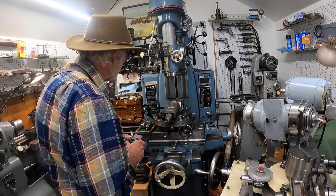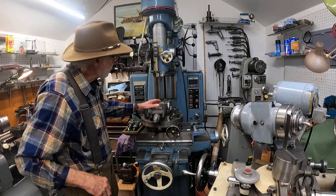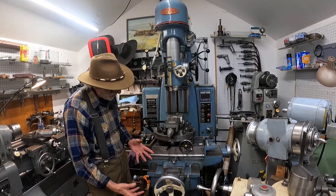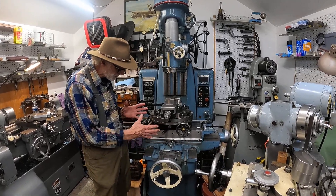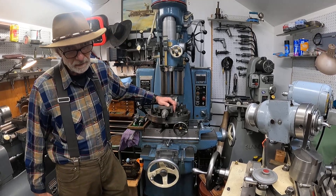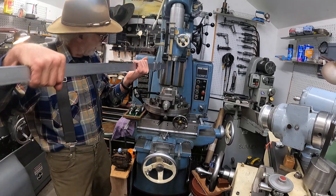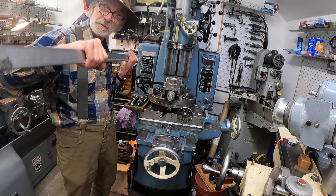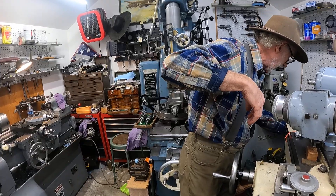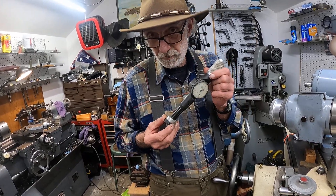I wanted to point out a couple of other things about the jig borer that might be interesting. On most machines like a vertical mill, you've got to get a caliper — you don't have much room, you have to move the knee or the table. This is different because it has non-influence table locks, so you can move these movements and get them back exact. On a regular vertical mill you've got to somehow get calipers in there and measure, and that's pretty tough. We want to do things cleaner than that, so we'll check our holes with dial bore gauges — they're much safer and better.